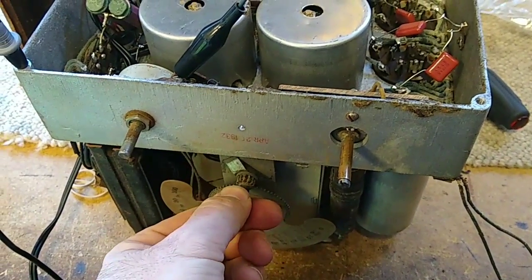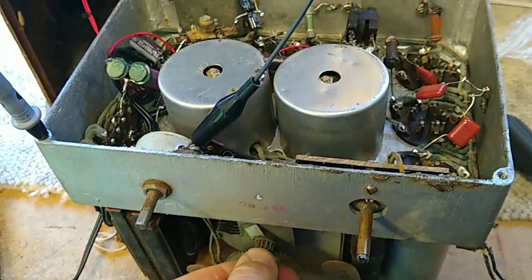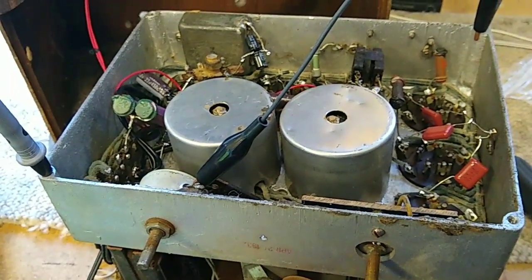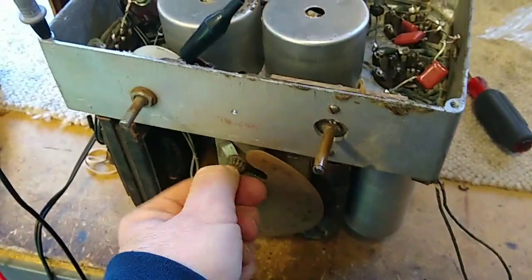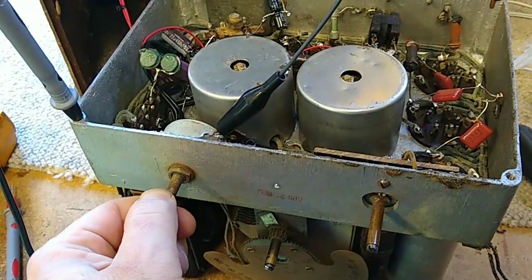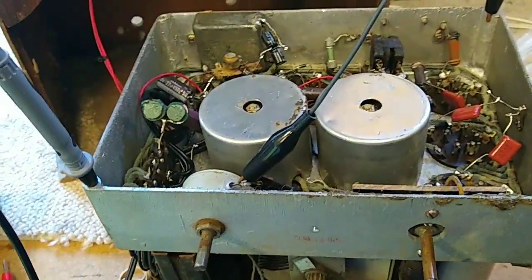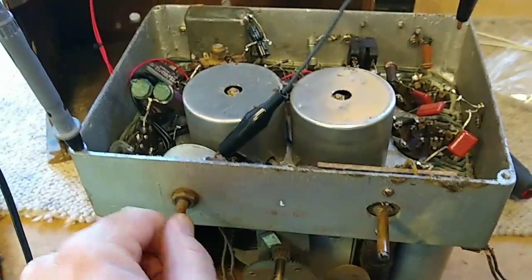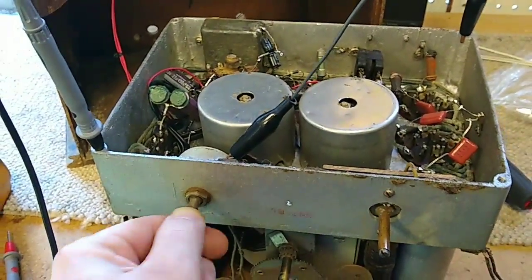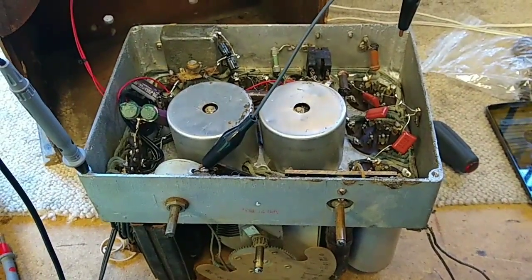Works like a champ - I mean, really good. And all my voltages on the cathodes and stuff kind of pop into place. And then it just dies. So this pot - rheostat, whatever you want to call it - it's trash. There's no resolution whatsoever; you just got to get it in the right spot. So I don't know what this value is supposed to be, but making progress. Really cool.